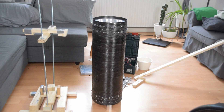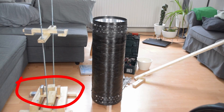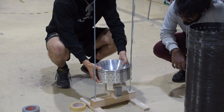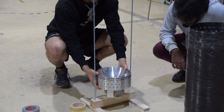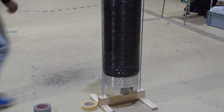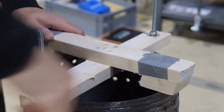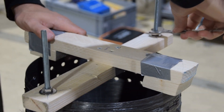To start off, we had the obvious first goal of getting that bulkhead into that CFRP tube. To do this, we created this contraption here, which has a pusher cross that sits on the top of the CFRP tube. Then we have the bottom, which holds the bottom bulkhead as we push the upper CFRP tube into that bulkhead. We have two rods that run up the length of the tube, and we have some nuts at the top that can be screwed in order to push the cross downwards.